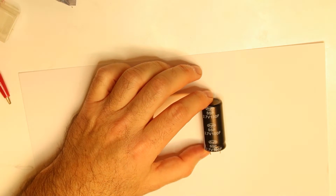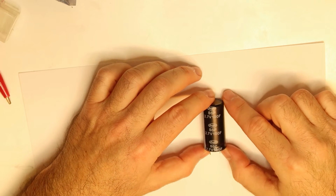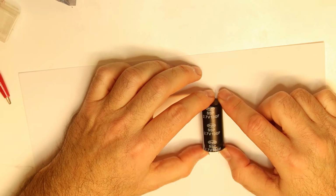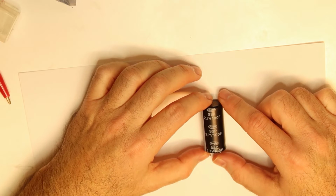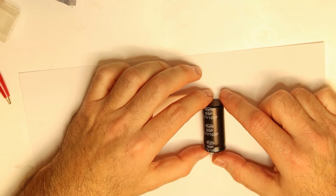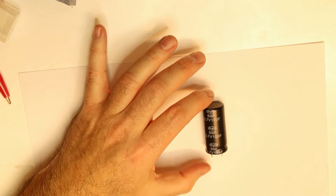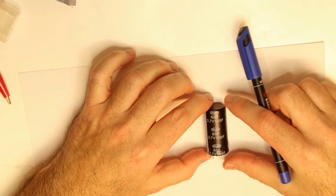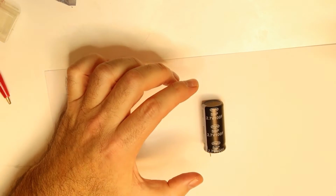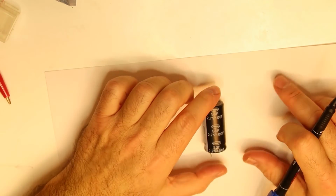And there are two other interesting things. First, the internal impedance is claimed to be 8 milliohms, and the short circuit current is 225 amps. This is by the data sheet. So I have to check it, and someone asked me, how do you know what the capacity is compared to a battery? So let's go over the formula and try to understand how it goes.